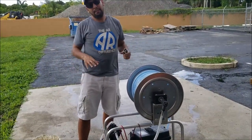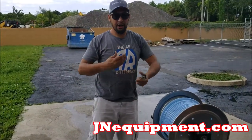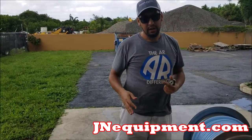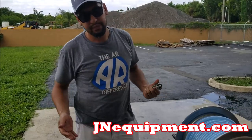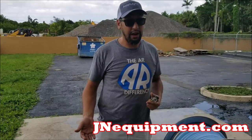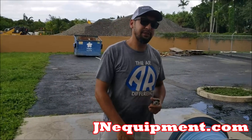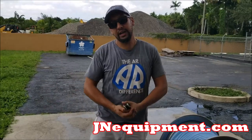All I want to know is that my pump is running in a smooth state and not turning on and off, on and off, on and off all day long. Because the switch isn't designed to do that, and it will fail. It absolutely will. It's what's happening to a lot of people out there, and I almost guarantee most people won't make it to the end of the video to take that piece of advice. So if you did make it that far, you probably have a leg up.